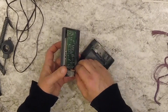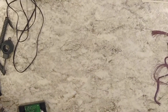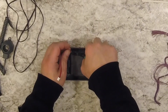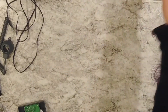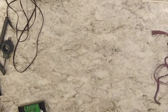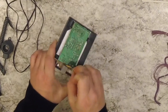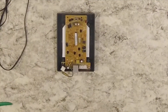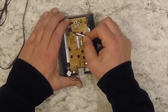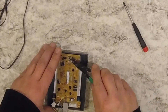Make sure you check out the first video so you know how to do this. Crack it open and unhook the cable from the battery. Next, cut that battery cable right off — leave yourself as much wire as you can because we are not going to use it at all. Pop the board off, flip it over, and disconnect it. Then pry the head off just like in the other video to get the plastic piece out, and cut the two LEDs right off where they stand.